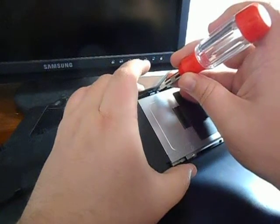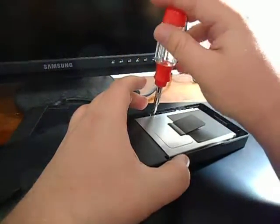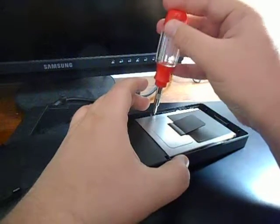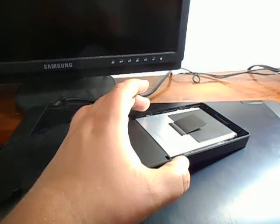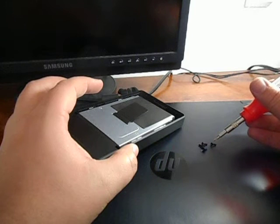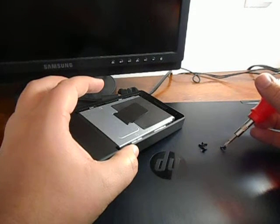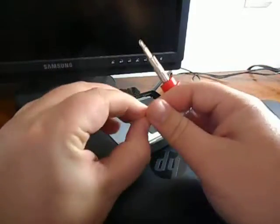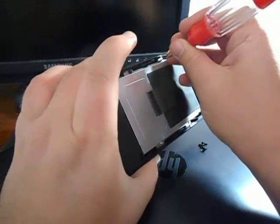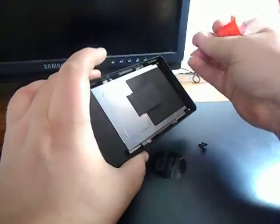These are slightly magnetized — very lightly. I don't remember if they came that way, but if you take the bits of a screwdriver and they're not magnetized, a lot of times if you just set them on a slightly powerful magnet for a little while they will actually gain some magnetism — not a lot. I cannot pick up the screw with it, but you see how it just holds on just a little bit. A lot of times that's all you need to hold the screw in place. I think I purposely left them on top of a strong magnet so that the bits would have some slight magnetism — not anything that would damage the hard drive itself, just enough to manipulate the screw.